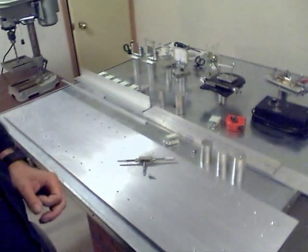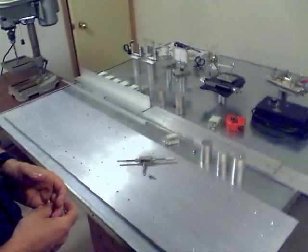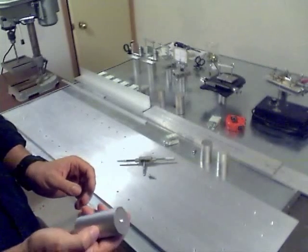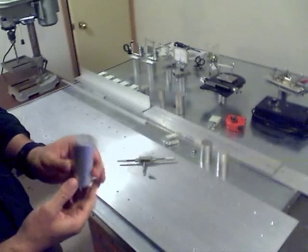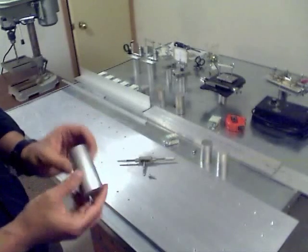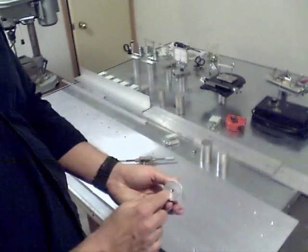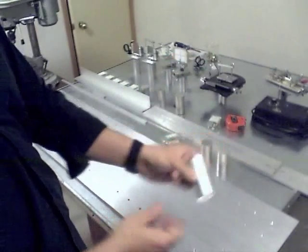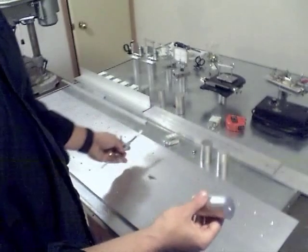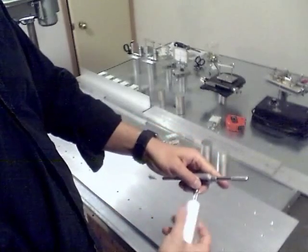The next issue with the optical bench is the mounting system. You're going to have to create some mounting posts for your different optical components. We've chosen to use a three-inch by one-and-a-quarter-inch rod of aluminum 6061. It doesn't normally have to be this thick, but I find it adds rigidity. These might cost you three or four dollars a piece and can usually be cut to size by the supplier. You also have to drill holes in either end of the mounting posts so that they can mount into the breadboard and so that your optical component can thread into the top. You just drill the holes with a drill press and then thread them as you did with the optical bench.